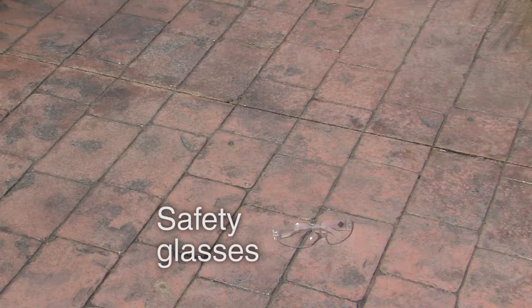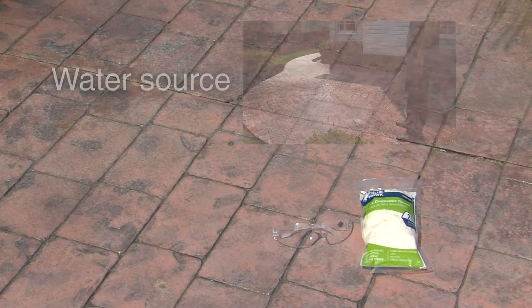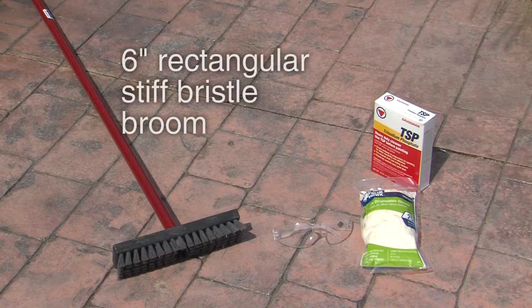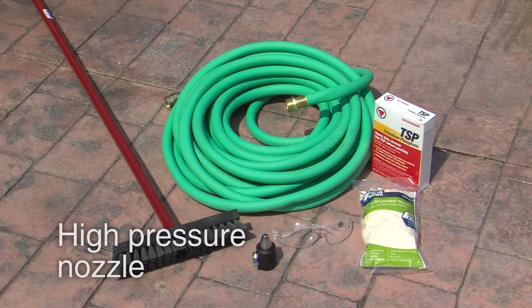You'll need to have several tools handy before you begin. First, be sure to wear safety glasses and gloves to avoid coming into direct contact with the product. For preparation of your surface area, you'll need a water source, a mild detergent cleaner — preferably TSP — a six-inch rectangular stiff bristle broom, sometimes called a deck brush, and either a pressure washer for best results, or alternatively a garden hose with a high-pressure nozzle.